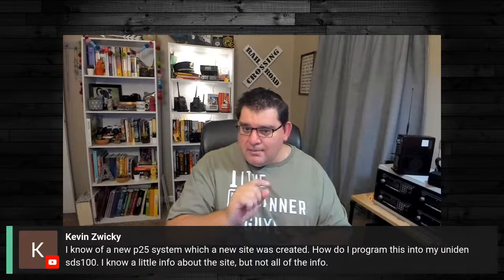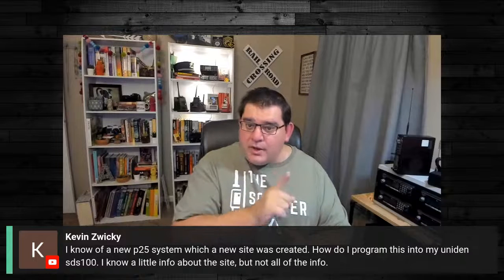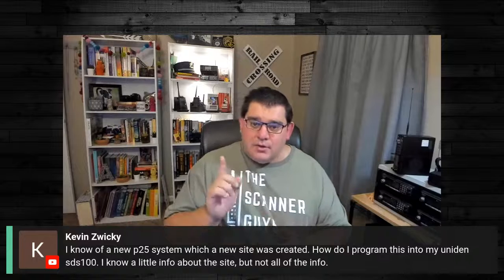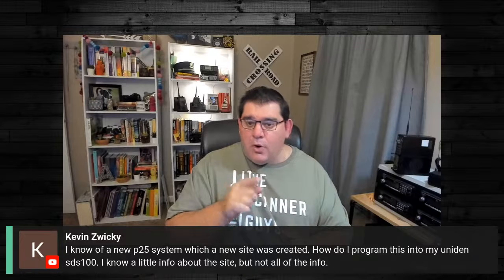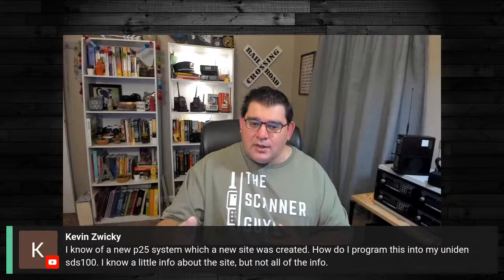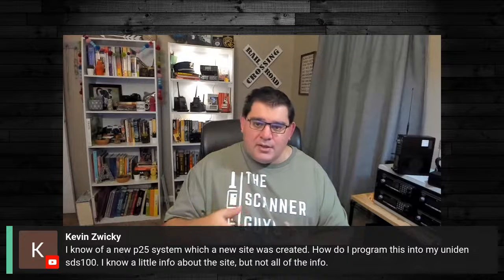Now, the first thing you want to make sure you do, you mentioned a new P25 site, is update the database, and also check RadioReference to make sure that update is in place for that trunk system. So if the update's there and it's been there for a while, update the database with the Sentinel software, which we did a whole video on a couple weeks ago. Once you've updated the radio, you could try the zip code based programming to see what you can get.